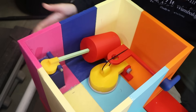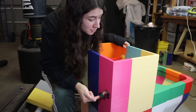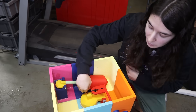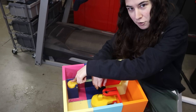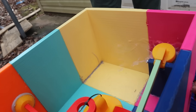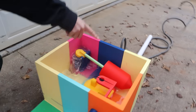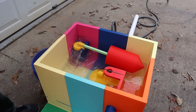Toilet time. This whole contraption is to refill the toilet. This is an attachment for a hose. Ideally the water will go up through this block. As the tank fills, this bobber — which is hollow — will get pushed up because it floats, and it'll seal off where the water from the hose is coming in. This is once again cursed. Let's try it. It's working, and look, it's not dripping down either. It's floating. The thing's starting to float.